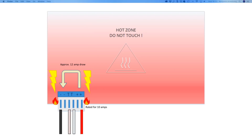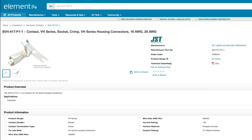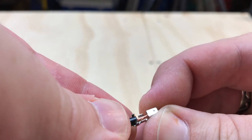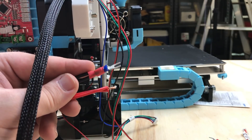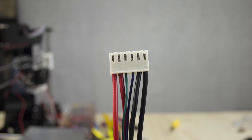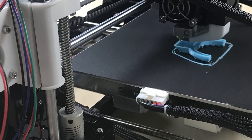The way I've chosen to address this issue is by purchasing a spare VHR-6N JST connector and the corresponding pins from an electronics supplier — I'll leave the link in the description. In my opinion, this is the most efficient way to solve this issue as it doesn't rely on you having soldering equipment or skills. Once you have stripped the wires and crimped them into the pin housing, you can slide them straight into the stock JST connector. Also remember to join and crimp the wires at the other end when connecting to the mainboard or the MOSFET. Now that a second power circuit has been added to the heat bed, the power load is distributed across four pins instead of two, reducing the load from 12 amps per pin to 6 amps per pin — which is under the 10 amp threshold for the connector. The total cost for this solution is less than $5 and uses the existing cable loom to keep things nice and simple.